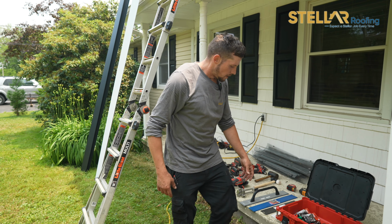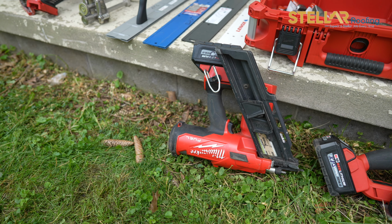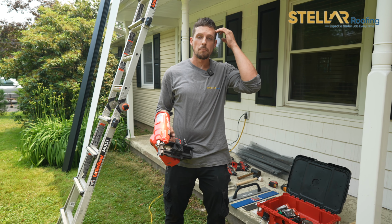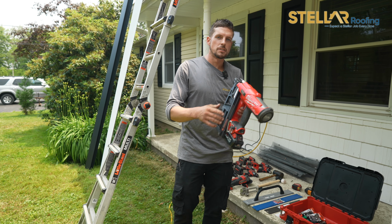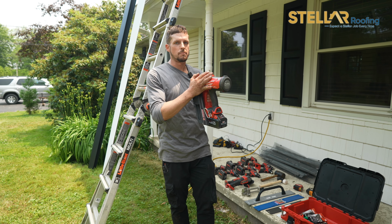Goes without saying. Next one on the list is our framer. We use this 90% of the time for systems that we're doing roof overs on. It is a very fast, efficient way. We have a couple of them. The guys get up there with our 1x4s, we line them up on the roof, and this is how we keep your purlin systems down. There's a few different size nails, but this system has seemed to be the best for us.